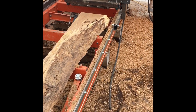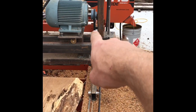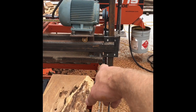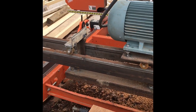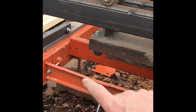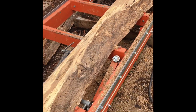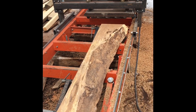I am super pumped about this. I still need to figure out — this head isn't going over as far as I wanted it to. We're about ready to touch here on the pulley. I'm kind of stuck — my bottom pulley can only go over so far. On this side I need to notch out. This piece right here was supposed to be long enough that it could slide underneath that tab there, but I'm about an eighth of an inch too short, so I'm going to have to take a grinder and cut that out. Definitely needs a few things polished up, but so far I'm really happy.